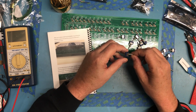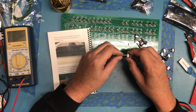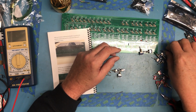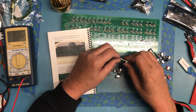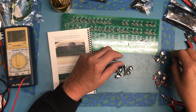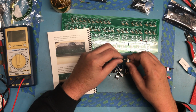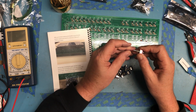Test each switch, and the pins on that one look okay. So in this case, these switches I don't believe are polarized. Especially these blue ones could go in either orientation. I will of course try to put them all in the same orientation just for consistency and because I'll know, nobody else will. Well, you will if you follow along on camera. You can see that these toggle either up or down. So I'll look okay. The red ones are a center off, so they can be clicked down or up.